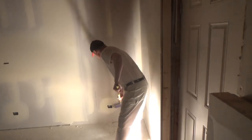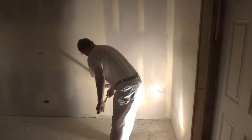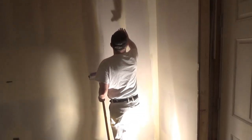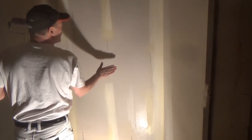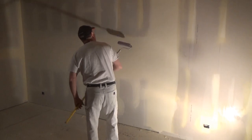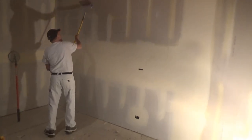I don't have to go over the mud — the nails or the screws — but I do have to hit all of the drywall that's dry. I have to get in between all of this stuff, because if I don't, it's going to show. I have to make sure that everything is wet and done in between here. What I'm doing is putting a thin film of drywall mud right on top of that drywall, and it's going to give it the same texture from wall to wall, floor to ceiling.